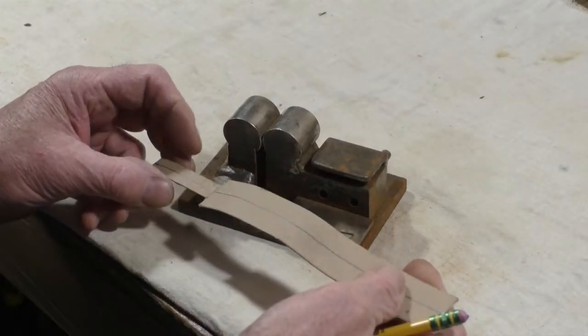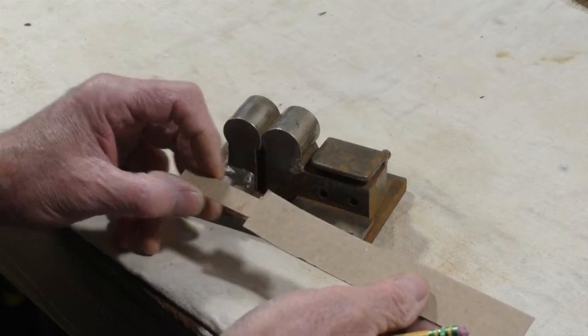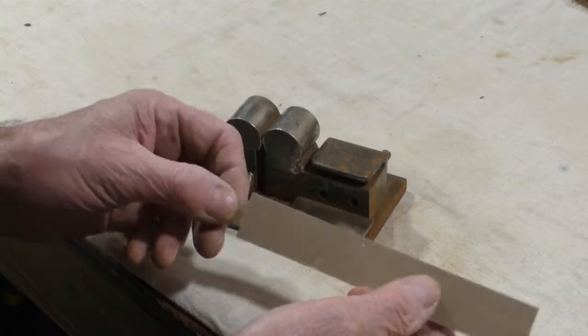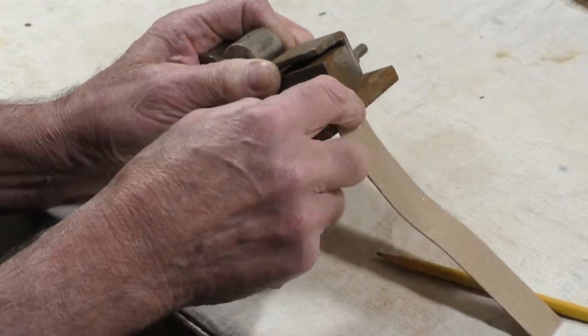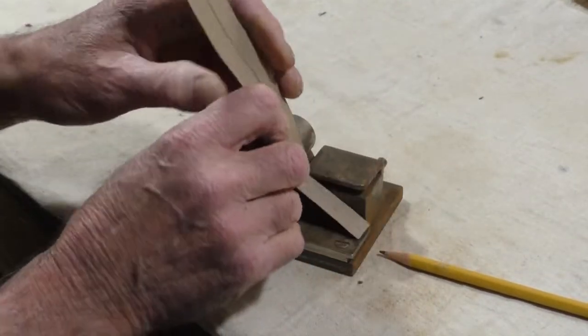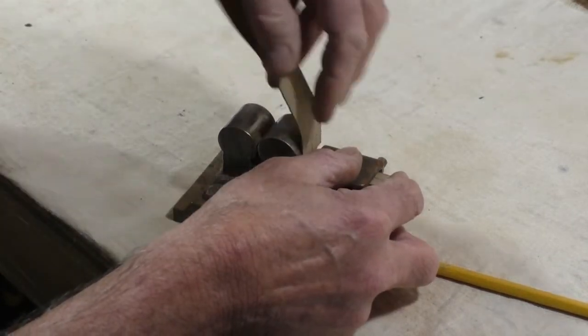So I made a cardboard piece, 1 inch wide, 8 inches long, and I've got this for the front tang down to 1/2 inch wide and 2 inches long. And when that's in steel, it'll be heated up red hot and bent at right angles on this part. And then that will go in here, and that'll be bent